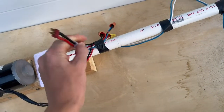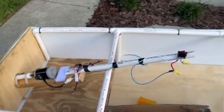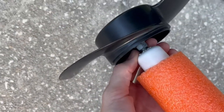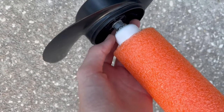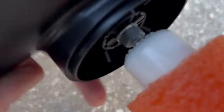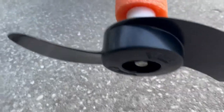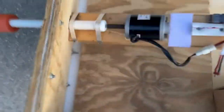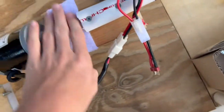Now it's all in place. On this end it's just an end cap with a hole drilled in it that allows the thread through, with a nut tightened down on a washer, and a pin through the threaded rod that holds the prop on. On the other side of the prop it's just another nut and a lock washer. When the motor spins, the threaded rod spins the propeller. The battery goes right here and plugs in here.